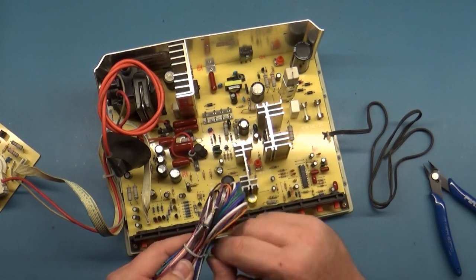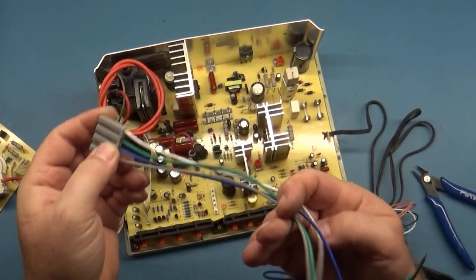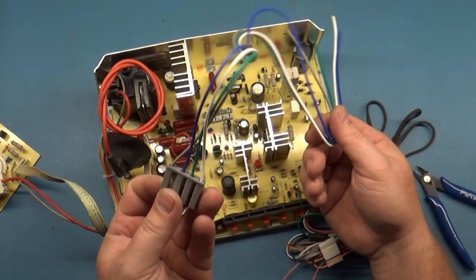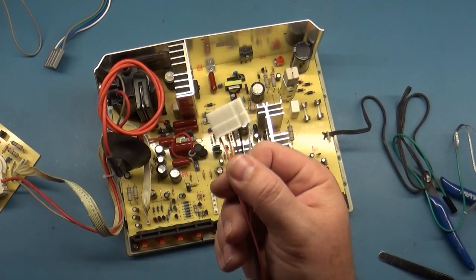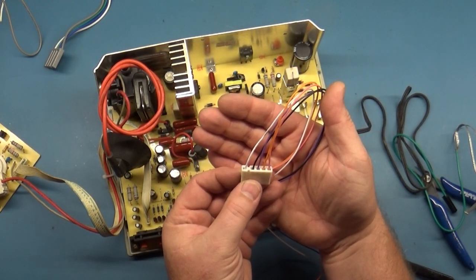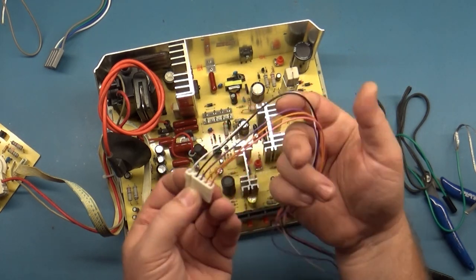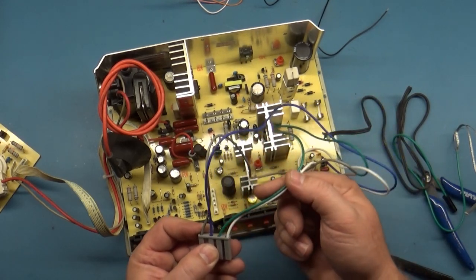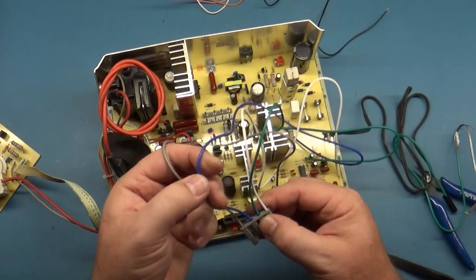This comes with a standard connector for the yoke, so you can adapt it to any tube with your standard yoke connector and then solder the wires. Of course it's not red, green, blue — they use weird alternate colors here. It does not come with your standard CGA connector; it comes with one of these connectors and they don't even use red, green, blue. They use pink, orange, purple, black, and white. So instead of red, green, blue, it's pink, orange, and purple. And for sync they use white and green for vertical, gray and blue for horizontal.